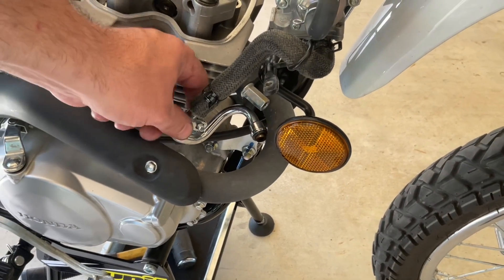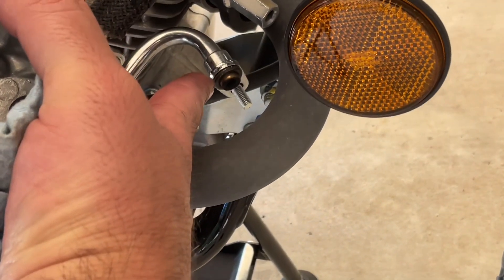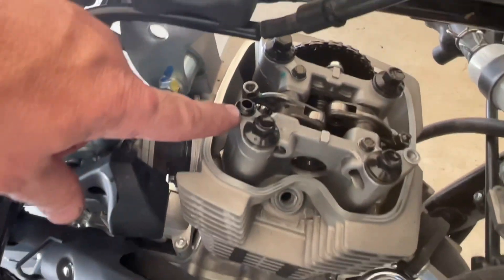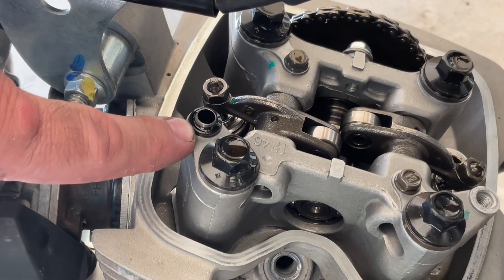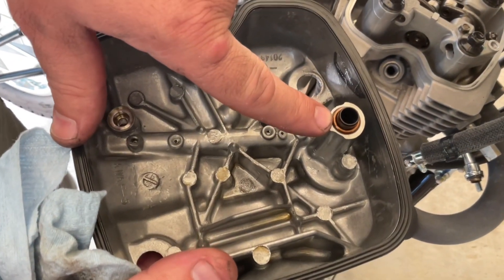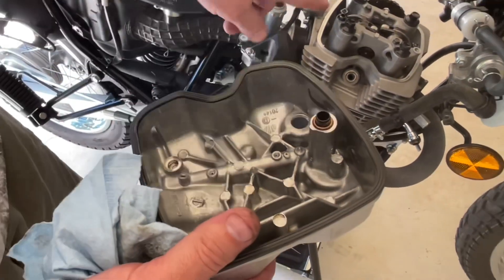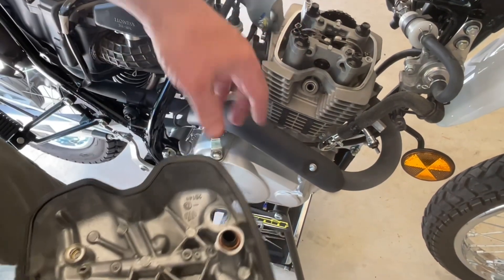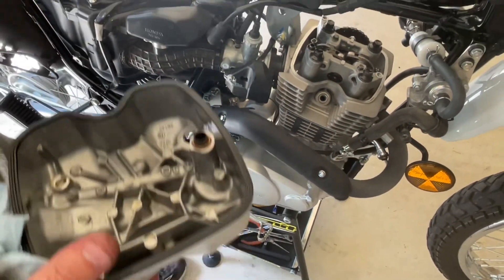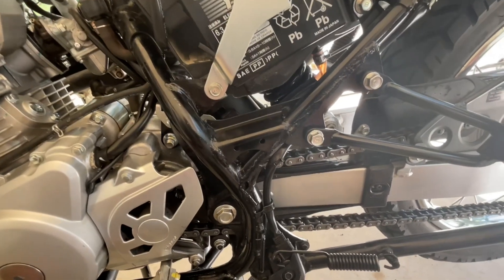Just a reminder — there's an O-ring right there on your secondary airline, there's another one on this dowel for your valve cover, and there's another one on the other dowel right there. Be sure these two O-rings are on before you put this on, and before you attach that to the top of this make sure that one's got it on there.